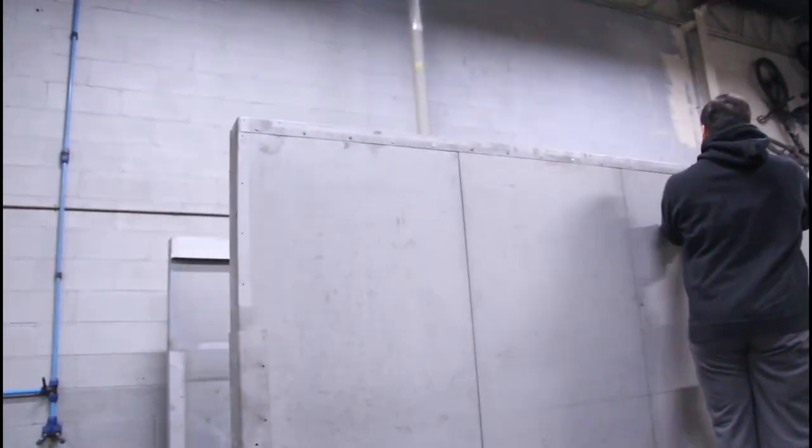We're putting up the two top, all the top caps up, so we can get our ceiling in. Once we have that, then we have an L angle that goes here that's going to support our vent panels. So essentially the height of the oven is at this point, and then this is a calculated relief for the CFM of the burner. So I have Arlie up there screwing up the top caps, so everything's tight.